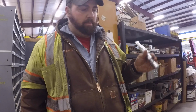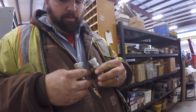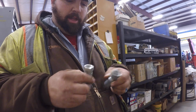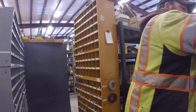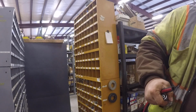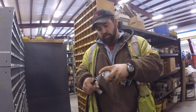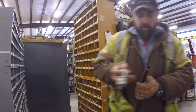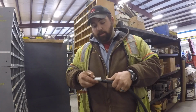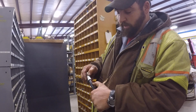I'm going to get that, and then I'll start building these hoses, and then we can try out the angle on our blade. I got the right ends to fit the blade. They're just 1/2 inch female pipe. So now I just have to put them on the hose. So I normally put a little lubricant on, just so they'll slide up in there good. I normally hold it beside the hose just a little bit, so I can see how far it's actually supposed to slide up on there. That way I know how far it's on there when I put it on, because it's hard to tell.